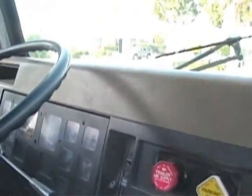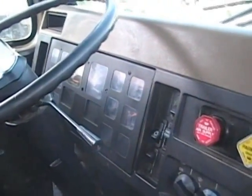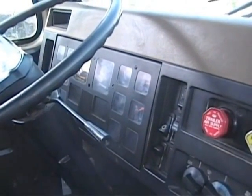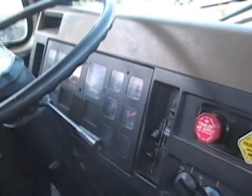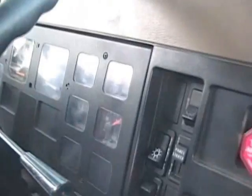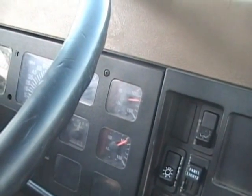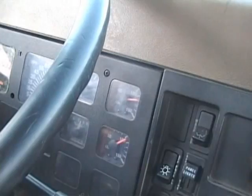Then you're going to hold the pedal down for 60 seconds. Within that 60-second period, you cannot lose more than 4 psi. So I'm going to apply moderate pressure. My primary is at 120. My secondary looks to be right about 102. I'm going to wait 60 seconds. I can't lose more than 4 psi.